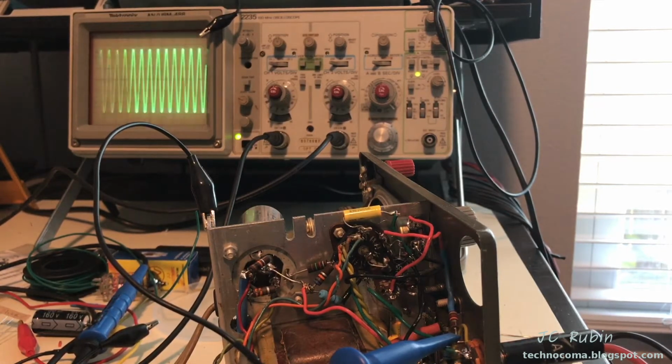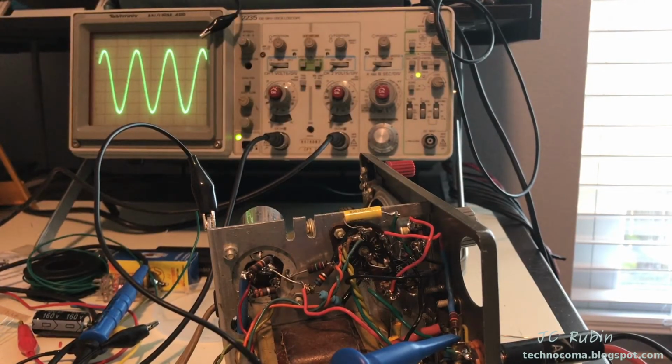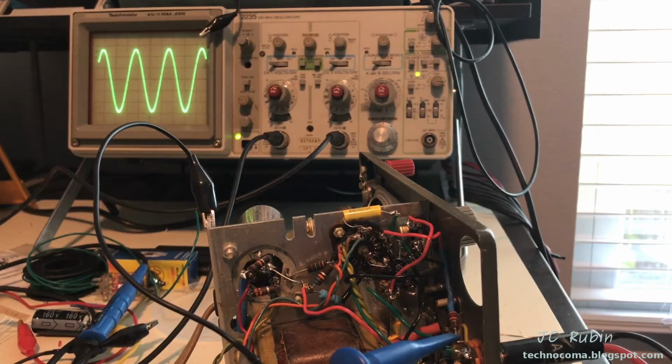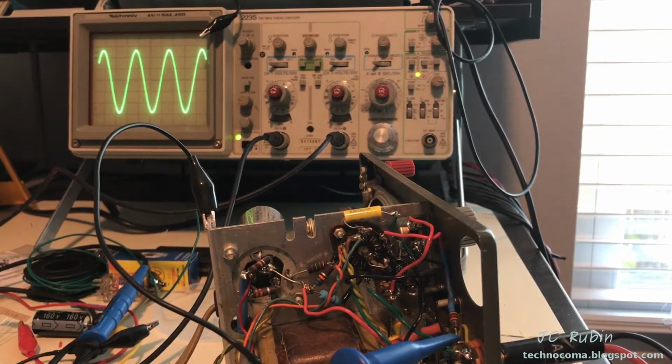And what I'm going to do now is I can see, looking at the oscilloscope, that there is clearly no distortion coming into the unit. It stands to reason. We're gonna walk the stages through, and we're gonna see if the distortion is appearing in the 12AX7, and if it's appearing in the beam power tube. We're gonna see what we could do about it. See if we could cut back that bleed off resistor from the beam power tube and see if that could fix it. But definitely way too hot here.